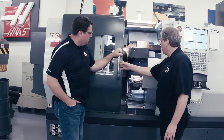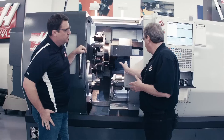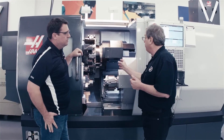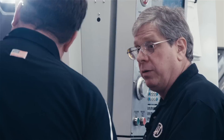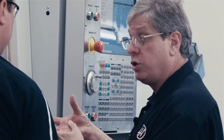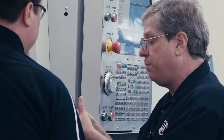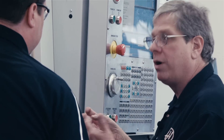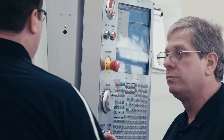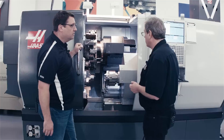It's actually really simple. I've got a part in here that's our demo part — it's already machined on operation one. I've got the B-axis positioned ready to grab it. All we do is start the spindles, give it one G-code to synchronize those spindles. We open the chuck on the secondary spindle, come in, grab the part, release it with the main spindle, pull back, and we're already machining operation two. So all that synchronization happens with a single G-code? Yep. Can we see it operate? Sure.